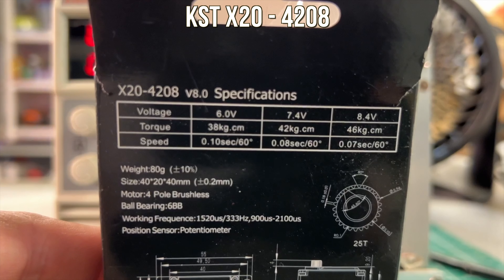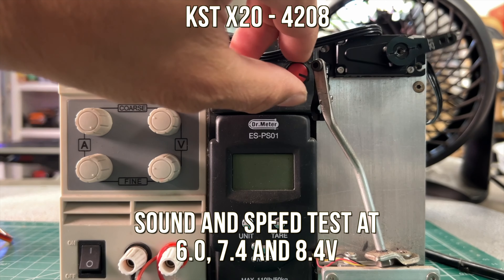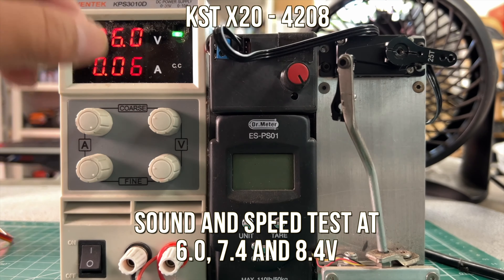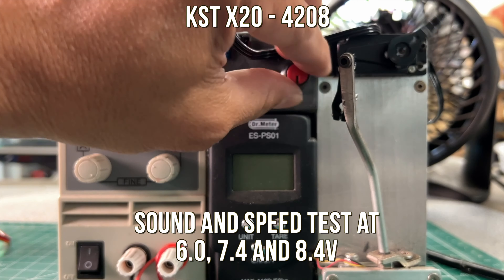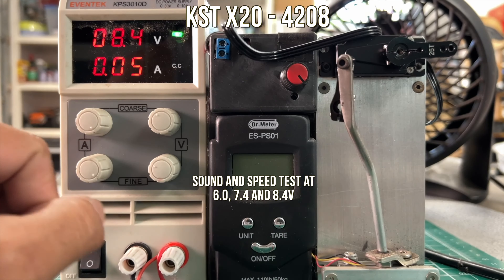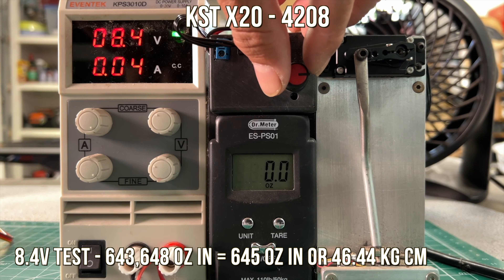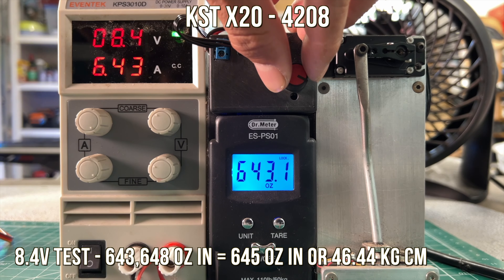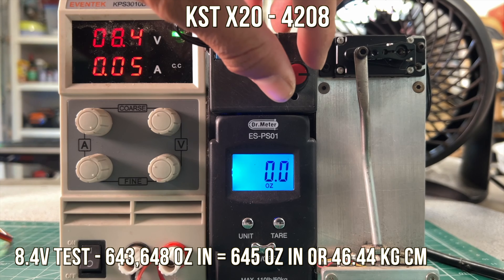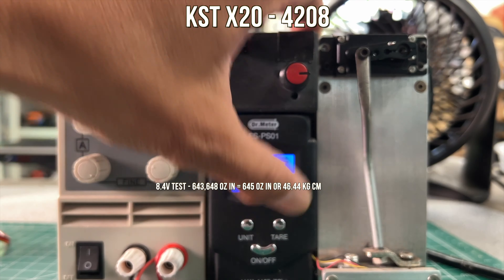The last servo is kind of a beast — it's claiming a lot but what's really impressive is that it's so fast: 0.07 seconds to do 60 degrees of throw. Put this on your X-Maxx or your high speed car and this thing is going to fly. You just don't see that kind of speed. The higher pulls come in at 643. We like that they don't overstate their claims and that these are powered by the ESC or BEC rather than direct powered, which complicates wiring and switching. The tally is 645 ounce inches or 46 kg.